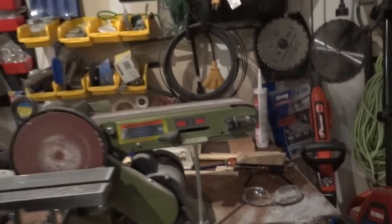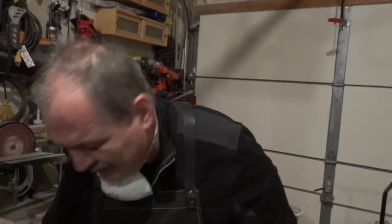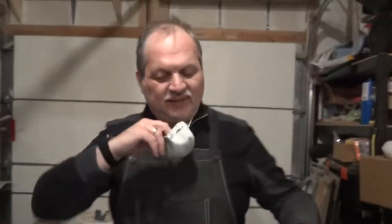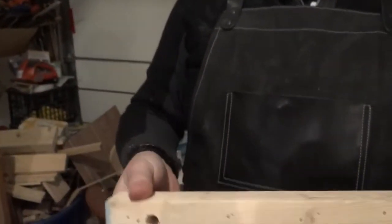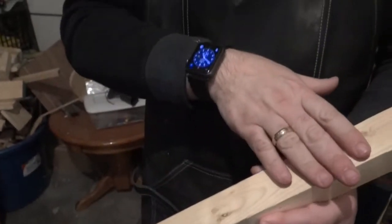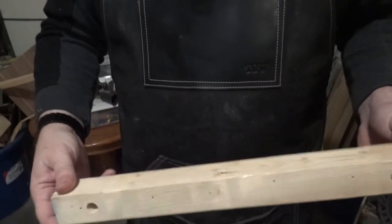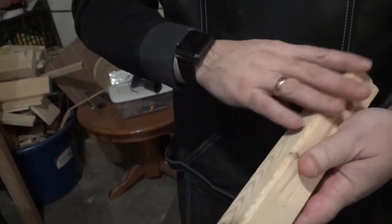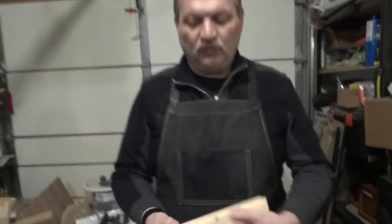Anyway, so we finished all our pieces of wood and she took them away, so I don't know where they are. They're right over here. So just as a reminder, in all of the pieces, of course, we did the 2 holes, and the piece is going to sit like that. We left the bottom part of the piece flat, so it will have a very nice, steady contact with the ground. But on the top, we actually beveled the 2 sides, so even if you're barefooted, you're not going to get a sharp edge, and also we feel it's going to look better.